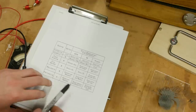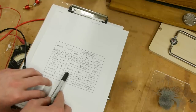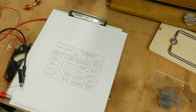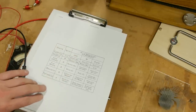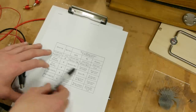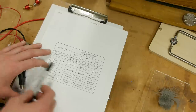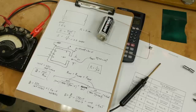Another thing to keep in mind is that there are multiple unit systems for magnetics. The English system is almost never used. It seems to be about half-and-half split between CGS (centimeter-gram-second) and true SI units (meter-kilogram-second). In this video I'm only going to use SI units. If you come across 'gauss' just know it's the same as tesla with a conversion factor; an oersted is the same as amp-turns per meter. I would recommend sticking to one system until you have a really good conceptual grasp, then you can do conversions in your head.